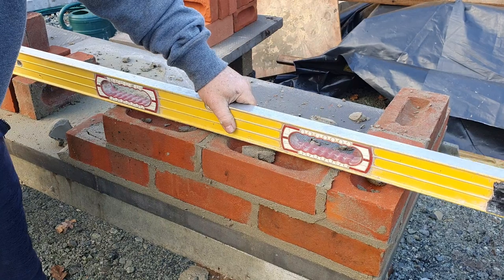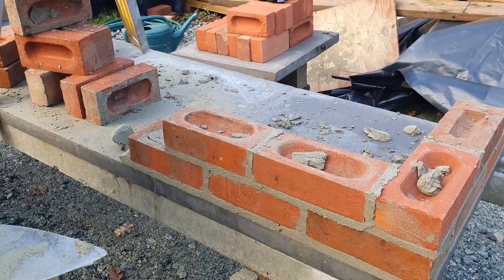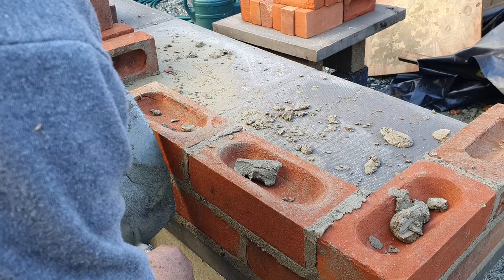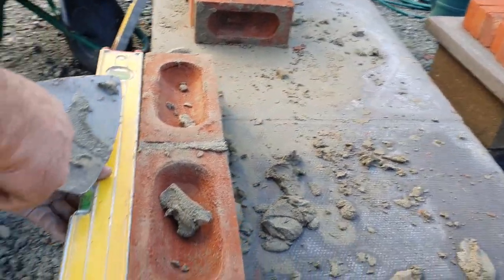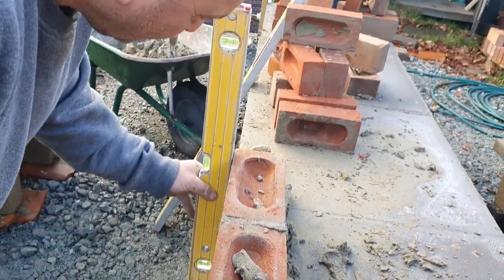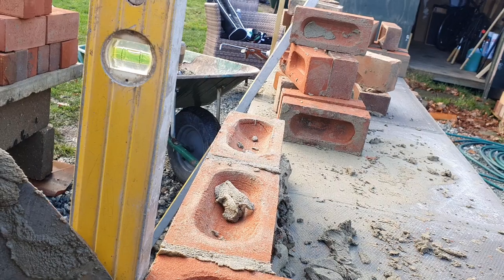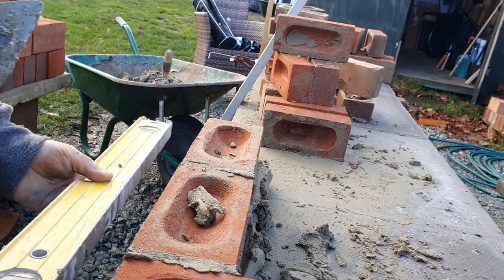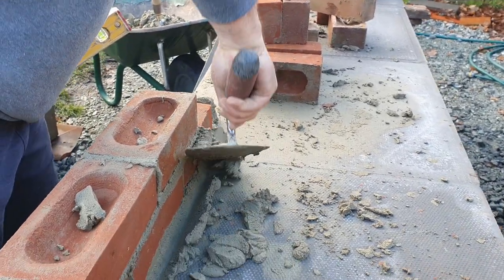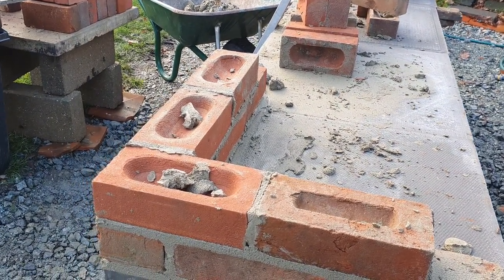I like to use the level along there — get it like that. And again we'll repeat the process, trying to get that piece upright. So now we know that's upright — you can see we're knocking it together, and that's how we get it a little bit straight. Then we'll just double check — make sure you're there. That's pretty good. Double check the corner — that's just gone a little bit, and that's only because the bricks are wet. Get that there, and again look, just double check it and look on the back. We're two courses in, another two or three courses on it.